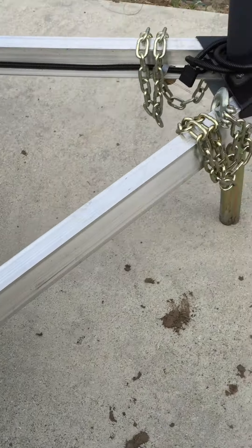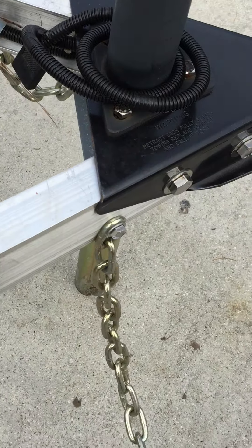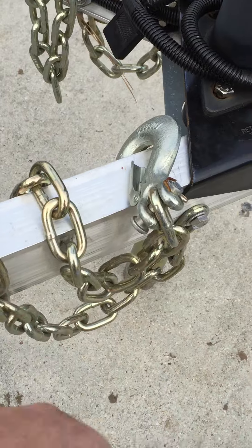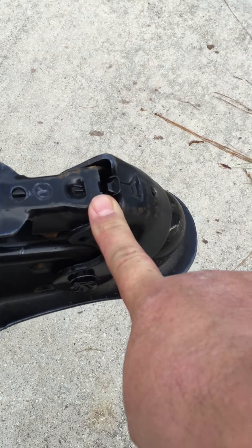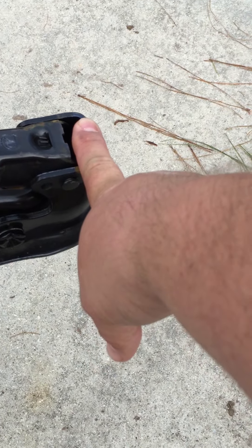That's how much that trailer is going to deflect. The safety chains are heavy-duty grab hooks — slip hooks rather — bolted on. I don't let those hang down in the dirt; I always lay them up on top of the frame. The frame is a three-inch channel iron — C-channel aluminum. The coupler is an Atwood-style yoke coupler, not the flip-over Fulton. This particular coupler goes forward and latches down; I like these because it has to defy gravity to come unlatched.